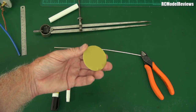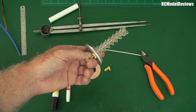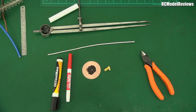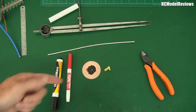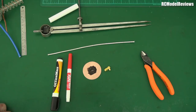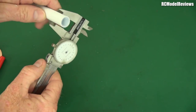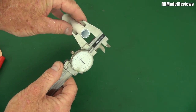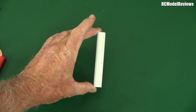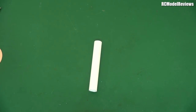For the reflector, it could be copper, steel, or aluminium - Circular Wireless use aluminium, but the problem for most people is you can't easily solder to aluminium. A piece of circuit board works well. It could even be the back of a bean tin as long as it stays flat - any bends will screw up the reflections and cause gain loss. Get your 15 millimeter diameter pipe - this is actually 14.9mm but that's near enough.